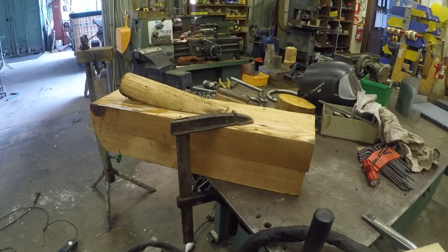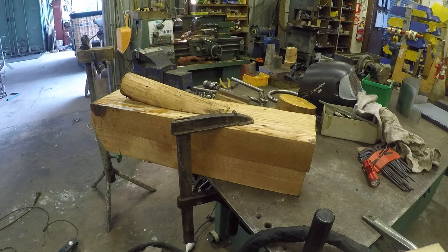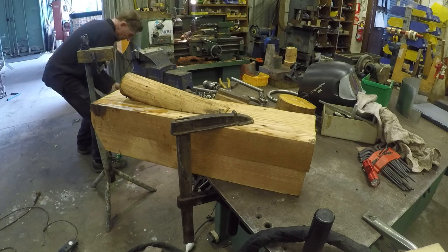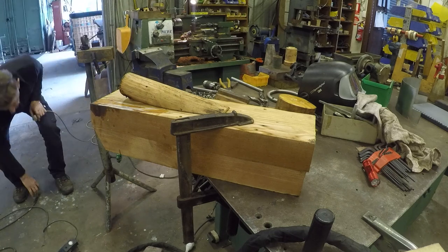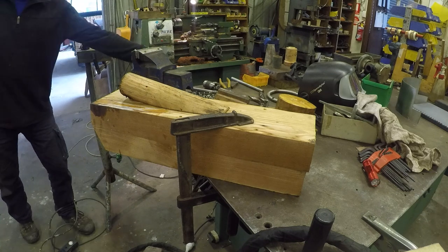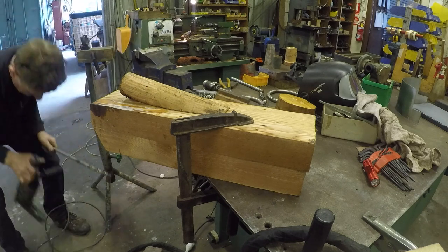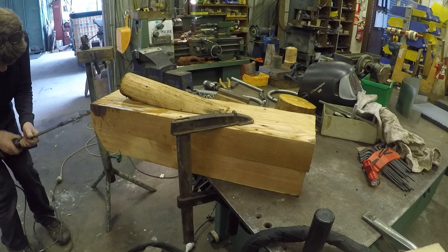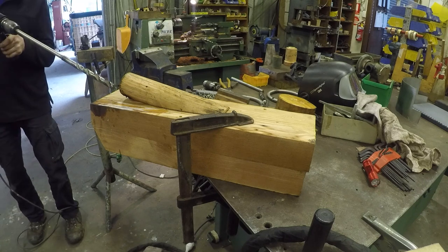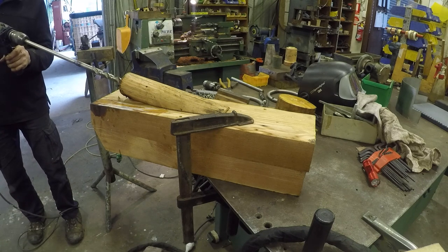This circular piece was turned on the lathe, and a centre hole was drilled, about 3/4 of an inch or so. Then that circular piece of timber was inserted into the shaft hole and then cut off so that it's a tapered fit on the bottom of this block. I then glued the block down to that while it was sitting in the tube. So now I've got a hole that's pretty well centered on where the shaft hole needs to be.